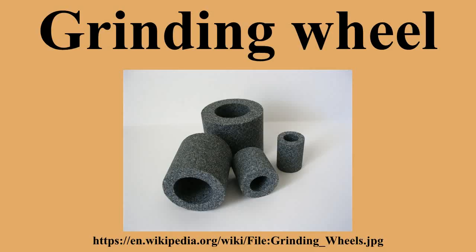Cylinder wheel. Ring cylinder wheels provide a long, wide surface with no center mounting support. They can be very large, up to 12 inches in width. They are used only in vertical or horizontal spindle grinders. Cylinder wheel ring is used for producing flat surfaces, the grinding being done with the end face of the wheel.